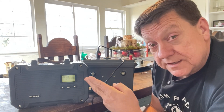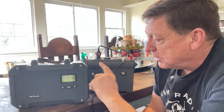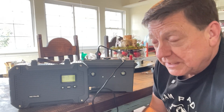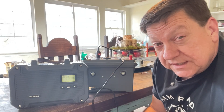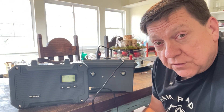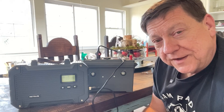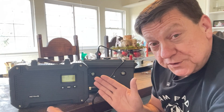In summary, this is a nifty little repeater with a lot of features and a really good output range. In the next video we're going to put a Raspberry Pi mini single-board computer on this as an external repeater controller using some Linux software — we'll get into that in detail. The programming is pretty basic: really you're just changing CTCSS tones or power levels, because the GMRS repeater frequencies are fixed. The only other thing you could change is wide band or narrow band per channel. What a great little device — the Retevis RT97L GMRS repeater has my seal of approval. It's portable, it's functional, and it's good to go when you are. This is Freddie Mack, your Ham Radio Crusader, saying 73s — wishing all the good signals to be yours, and ham on y'all.